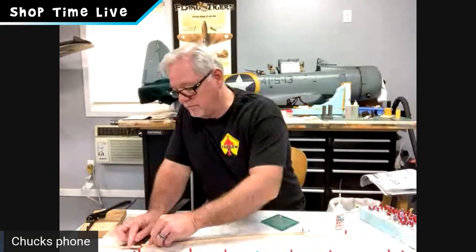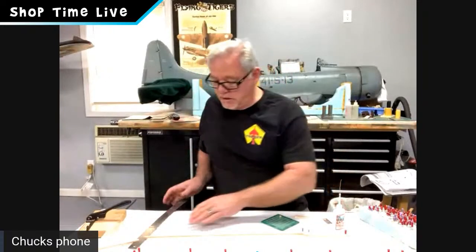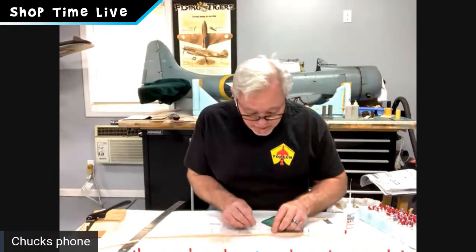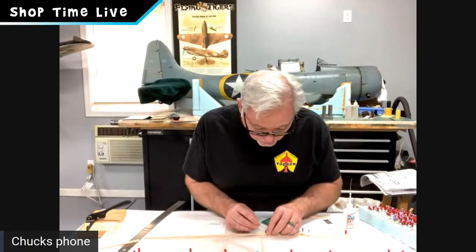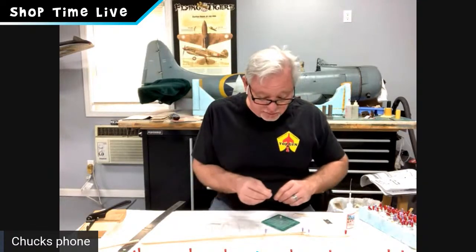Good stuff. All right. And I'm just running a little bit in front of Joe. So, and then what I'm going to do, guys, I've already got my bottom longeron started. And just to show you what I did, I pinned it at the top right next to the wing saddle and put a real thin drop of CA at the very top. Think of it as almost like a spot weld, okay? And once that's pinned in, then I'll start taking my other pins and I'm going to follow literally right along the bottom of the plan, or in our case, the bottom longeron, okay?